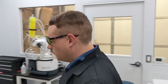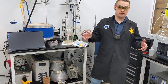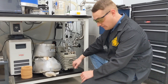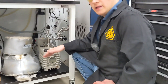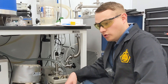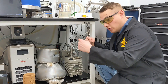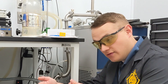The last type of pump we're going to talk about today is a wet vacuum pump, otherwise known as a rotary vane pump, which are probably the most commonly used pumps in our space — hemp and cannabis. A rotary vane pump is an oil-based pump. It's got a large oil reservoir on the back end, which as you can see is filled about 50% up the sight glass with oil — between the min and max. We always want to make sure these pumps have oil in them when operating. Without oil, they run dry, similar to spinning your car's motor without oil, which will quickly seize it. The oil lubricates the pump and also helps create vacuum: the vanes spin and create displacement areas, which the oil fills, and as it's pushed out, vacuum is created.